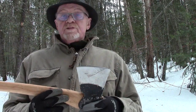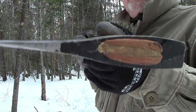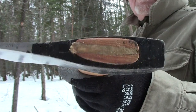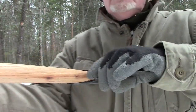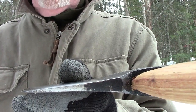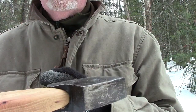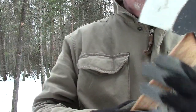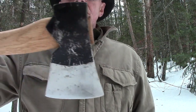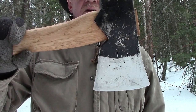I have no steel wedge fitment on there, just a very close fit into the eye with the wedge driven deeply at two-thirds depth and absolutely no gaps around the entry of the haft into the head of the axe. I'm also quite pleased with the angle of how it sits on the new shaft - it should be a very good cutting angle with a very slight downward turn, positioned very well.